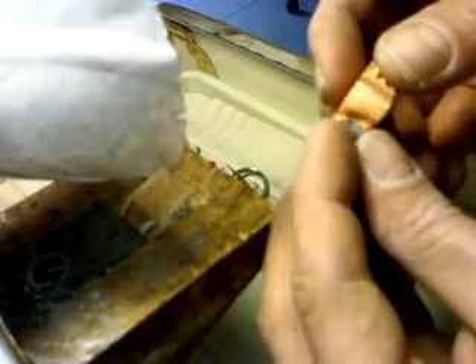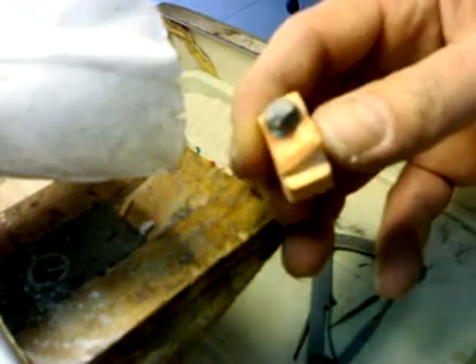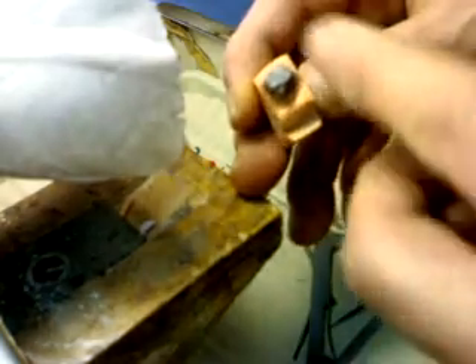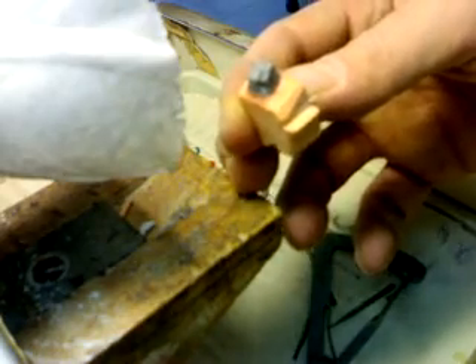There we go — that was nice to have it right off the bat. I will be using a heatless stone, which is this here, and I will be cleaning off excess of my spruing channel. Then I will get back to it with another type of stone, and we will see how the outside surface of this core will be presented on the final work.